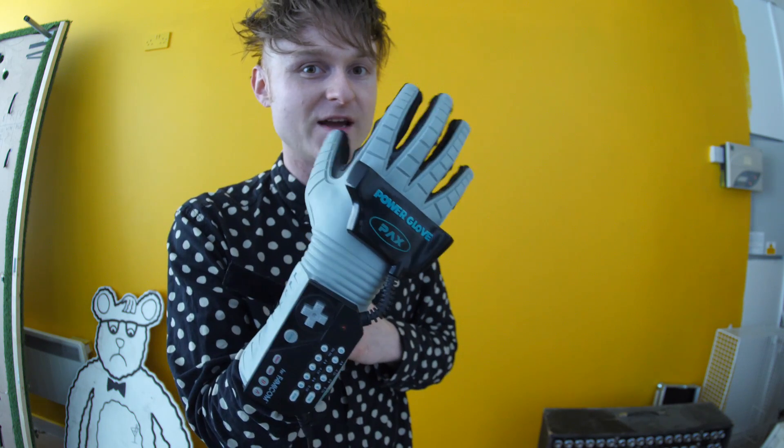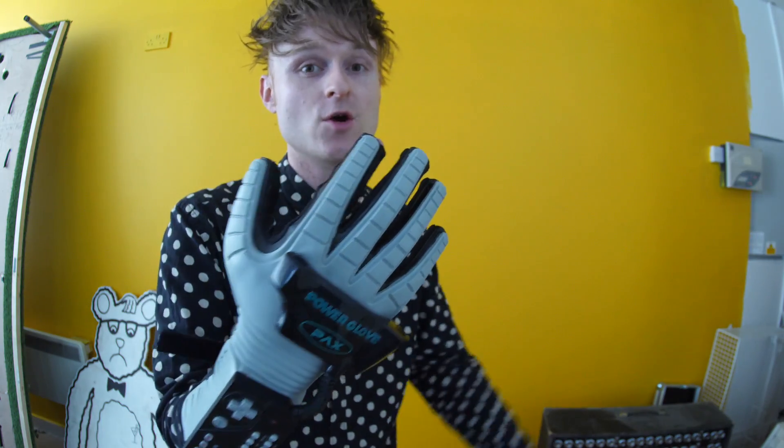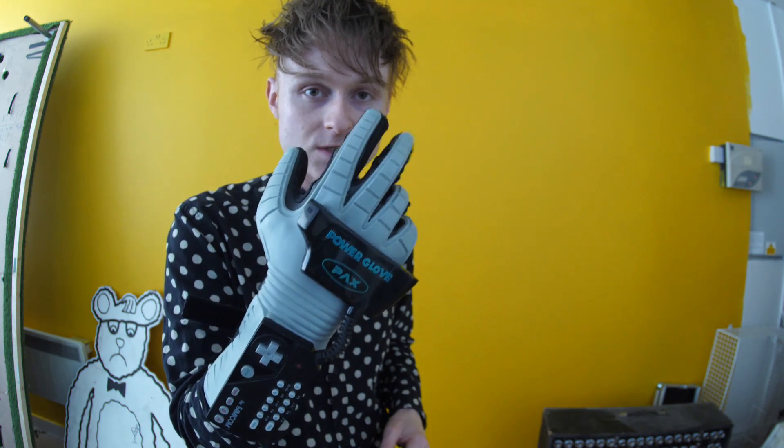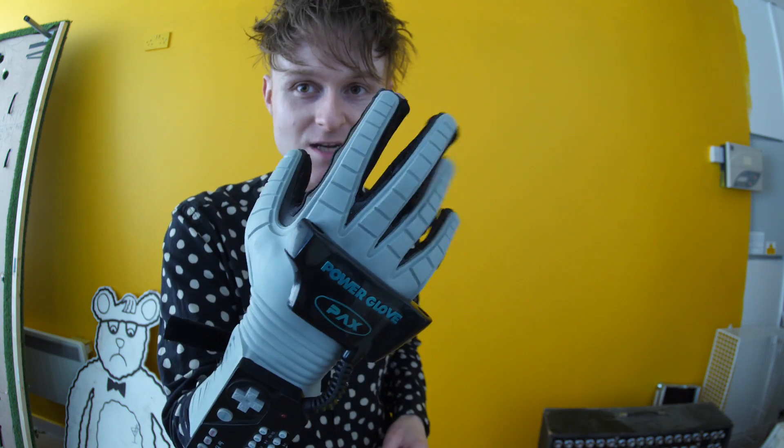There are a number of modifications I want to do, but I want to start simple - starting with the fingers. I really like how they bend. Apparently there are pressure sensors in here, and if you read the fingers through the original circuit you won't have the best resolution. So the first thing I'm going to do is break these fingers out into analog voltages so I can control my modular synthesizer with analog voltage fingers.